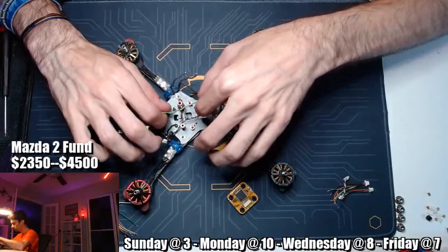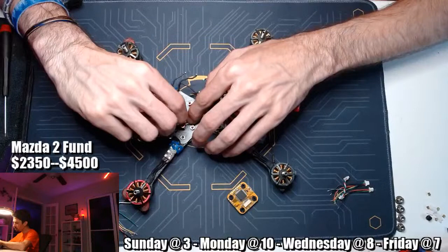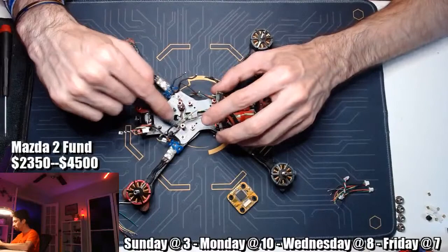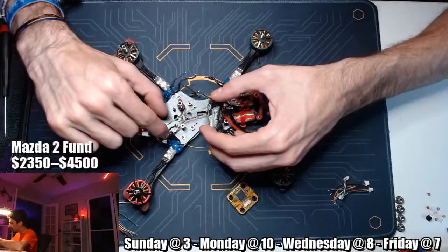We've got a microphone in here with audio going directly back to the VTX, and then it's got its own little positive and negative looking for 5 volts, so we've got to find 5-volt pads that are pretty close to this mic because I cut those wires really short from the previous flight controller. And then we've got this little bundle here, this green and yellow. This is hooked up to the VTX, so yellow is going to be video out from the flight controller, green is going to be smart audio.